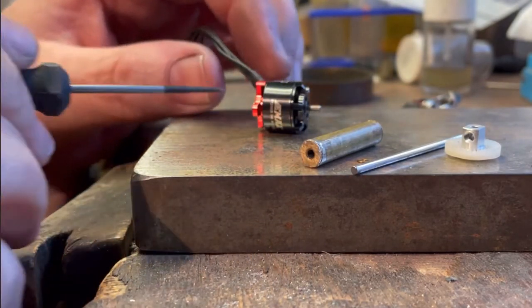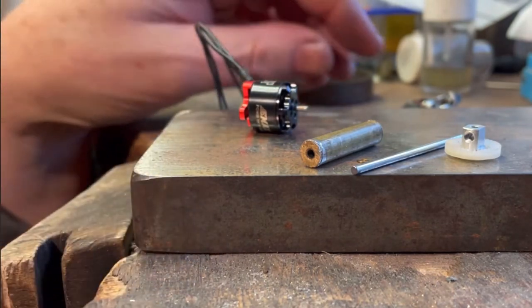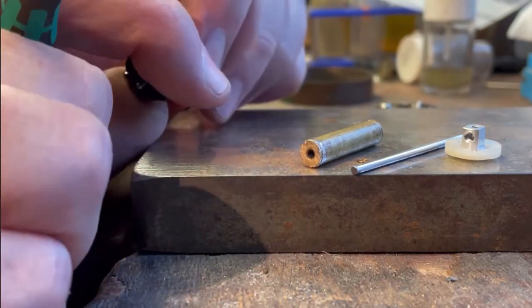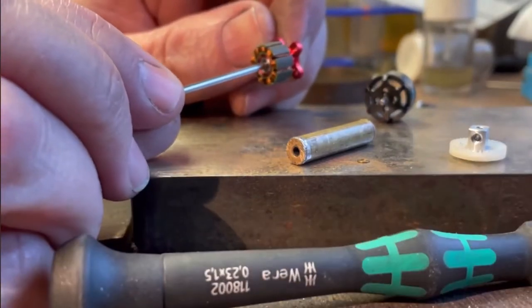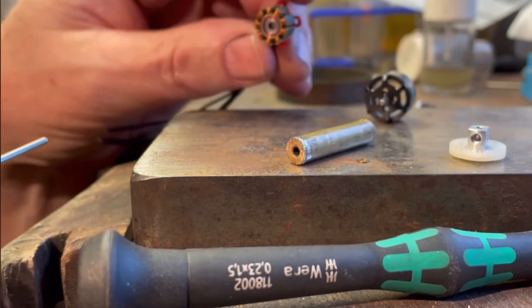First of all, there's a little circlip on the end here. Ping that off and stick it on a magnet somewhere safe, like one of these old strap motor things. Right. This just now slides out. Before you go any further, check that the axle actually fits through. You don't want to have one that's too tight.